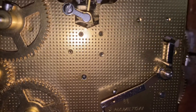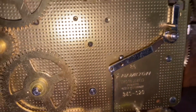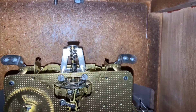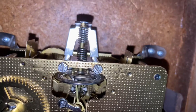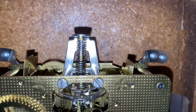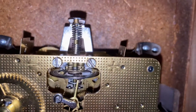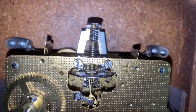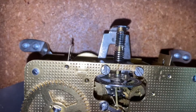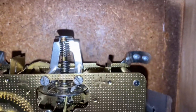I need to re-clean that pivot — god dang, that is disgusting. Anyways, the main difference you'll see is on the escapement. Now this is the old style escapement that they changed to a hairspring. This is what they call the true floating balance, and this is something you won't see on modern day clocks anymore, unless you want to put a vintage movement into a newer clock — and that's completely up to you.